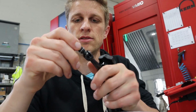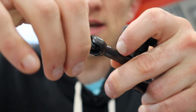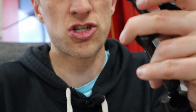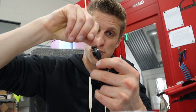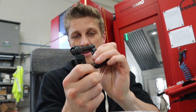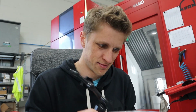Now I noticed, I never knew this, but the tip actually unscrews and leaves you with a metric M6 thread, which is the mounting screw that I use to mount the bracket on the thing. So I can literally mount the bracket with the whole float sensor on the end of this and adjust my level height to be 4.5 inches, which will just work until I print the bracket and it's perfect. But this will work really well. So let's go do that.